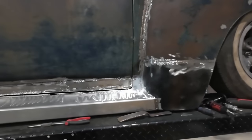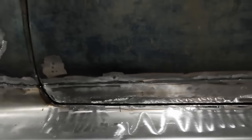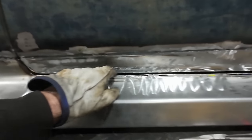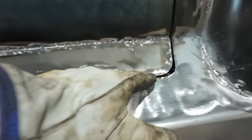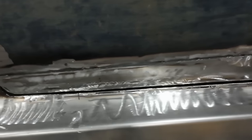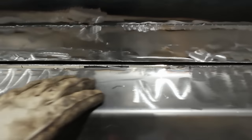What did I do, eh? So I was trying to ignore it, but I had to go back and revisit. I had it all welded. I don't know, I guess my cut, something wasn't straight. I buzzed it. I closed it. The gap was nice up in the front, but as it got over here, it got kind of goofy. So anyways, I cut it. It relaxed. You can see the size of the gap we got to fill here. So I guess we're basically MIGing it anyways.